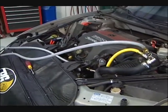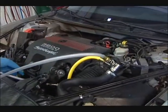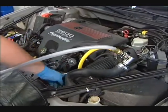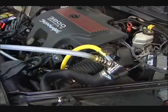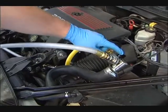Now to do this, we're going to have to make sure we've got our ball valve turned off. If our ball valve is turned on, the new fluid will just come right through our pump hose straight through our cross-flow adapter right back to the tank. We want it to achieve the flush, so we want to make sure that ball valve is turned off.